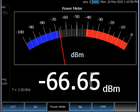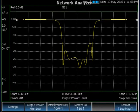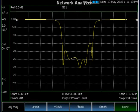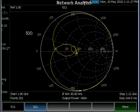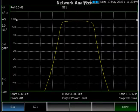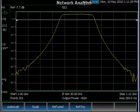Another feature is the network analyzer. The N9912A is a one-port vector, two-port scalar measurement. Here you can see the S11 of a bandpass filter. You can make an S11 measurement in various formats — phase, Smith, or polar chart. You can also make an S21 measurement, and you can change the bandwidth or the number of points to optimize your measurement.